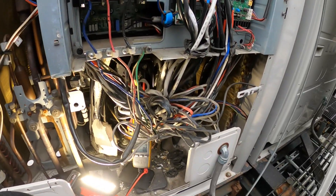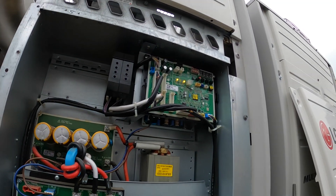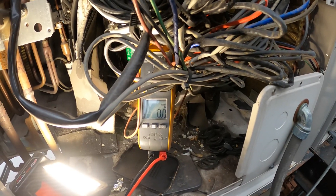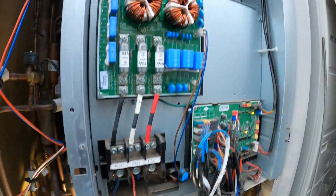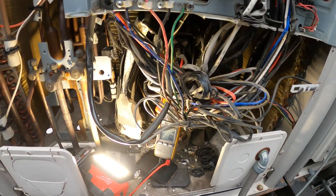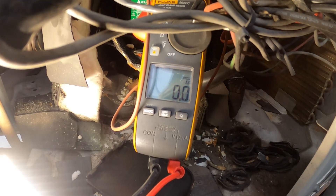Right now it's super chilly outside — it's about 35 degrees out here in New York City. Let's see if this thing is trying to start. The insulation definitely ran hot on here, that's why we saw all that. That thing is done. There's a good chance this compressor is bad. I'm just going to wait and keep an eye on these amps to see if anything happens.